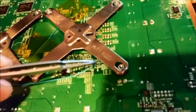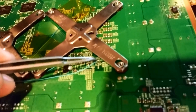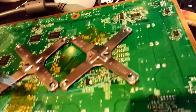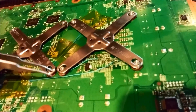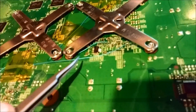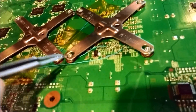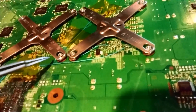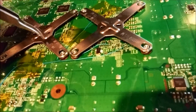Down here we have the old school PLL bypass point — if you look up the old RGH1 diagrams, that's where the PLL bypass is. For CPU RST, this is the alternate that I first became aware of as suggested with RJ tag. I found that Kynar — this really thin single strand stuff — works best with this method, and getting the wires as absolutely short as possible. There are little tiny holes here that run post and PLL bypass through, poking those through so they come up just underneath the GPU and CPU heat sinks.